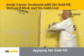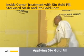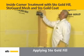Spread Stogold fill smooth beyond the edge of the mesh. Allow material to dry fully before overcoating with Stogold coat. Under normal conditions, typical drying time is within 4 hours.